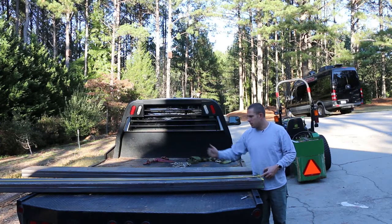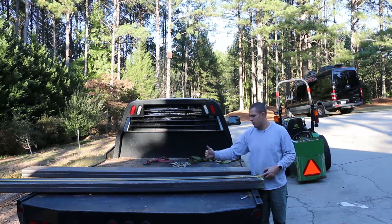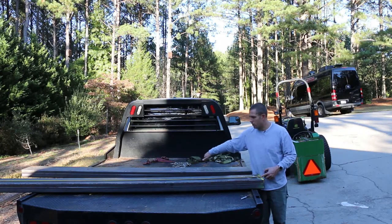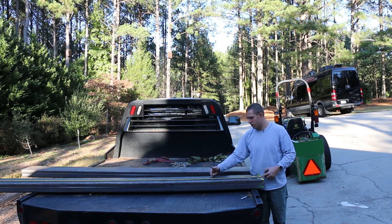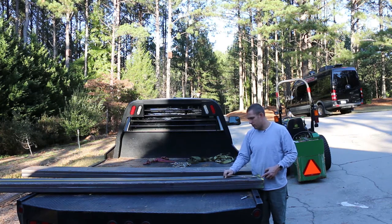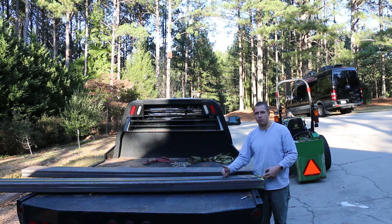So I'm gonna leave 6 inches at the top, and then I'm gonna have an 8-foot section between. My 8-foot is gonna be the outside of where the 3-inch square tubes are gonna go across, and then the body of that will be filled in with wood. And then I'm going to leave 3 more inches, so 8'6" here, and then 3 more inches between the bottom 3-inch square tube and the ground. So 8'9" leaves me just this section to put into the ground.